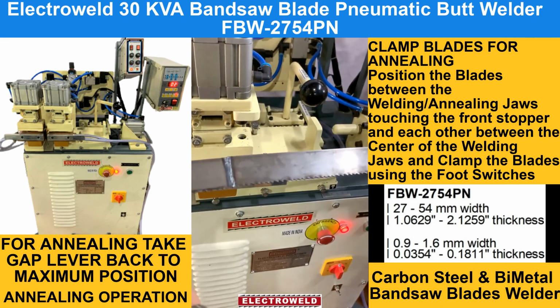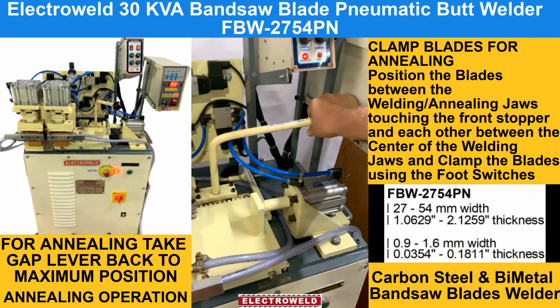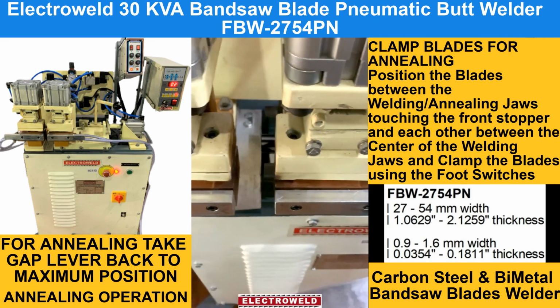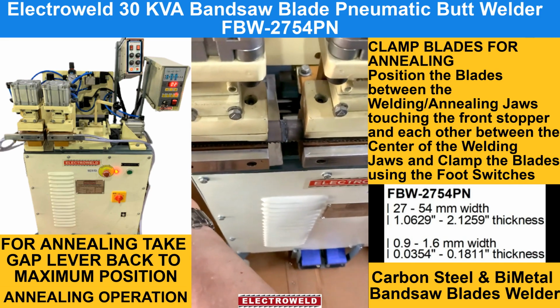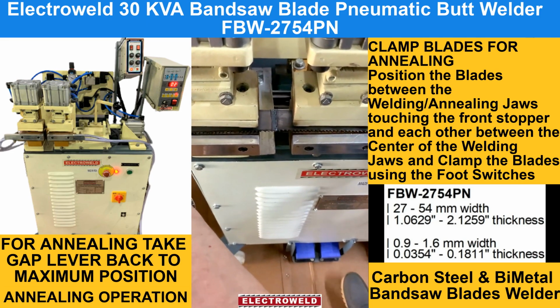For annealing, you can take the lever back to maximum position so that maximum gap is created over here. Then you can again clamp the blade. See that the welded joint is in the center of the welding jaws.